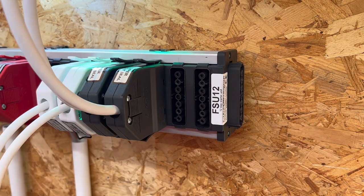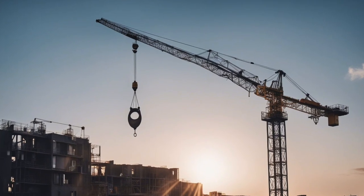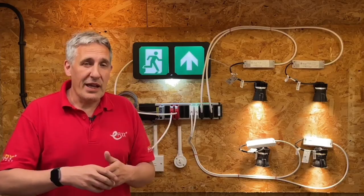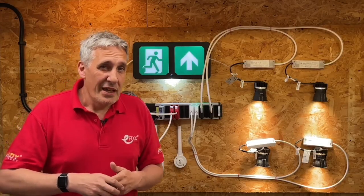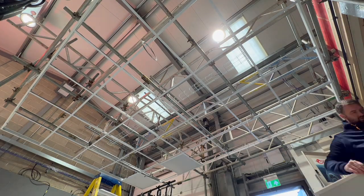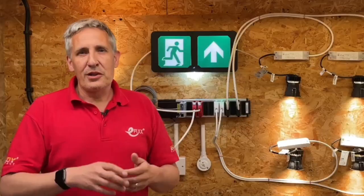Using a modular wiring system with plug-and-socket connections, changes to the layout can be made without having to alter the fixed wiring of the building. The fixed wiring can be completed during the construction phase before the final fit-out and ceiling installation, allowing decisions about lighting location to be made much later. Working closely with lighting manufacturers, you can have all fixtures supplied to site pre-wired and ready to plug in, improving site productivity and speed of installation.